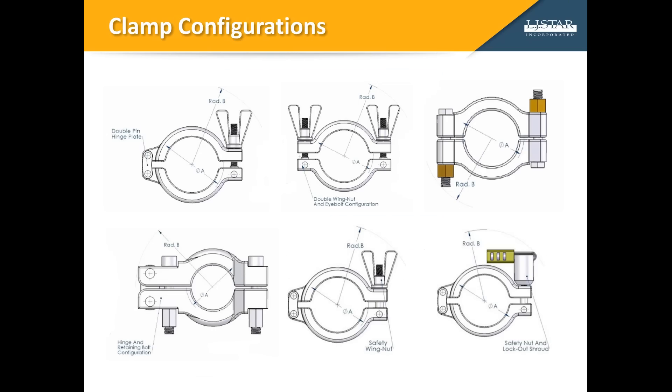Clamps provide the mechanical force to compress the gasket between the ferrules. Different clamp types include single pin, double pin, high pressure, ASME, safety, and lockout. Both wing nut and hex nut fasteners are available for securing all types of these clamps. Clamps are typically constructed of 304 or 316 stainless steel. Sanitary fittings have a polished surface finish to reduce friction and eliminate surface imperfections that could give contaminants a place to hide. The standard finish for food and dairy applications is 32RA. Pharmaceutical and biopharmaceutical applications use the ASME BPE standard, which ranges from SF0 to SF6.